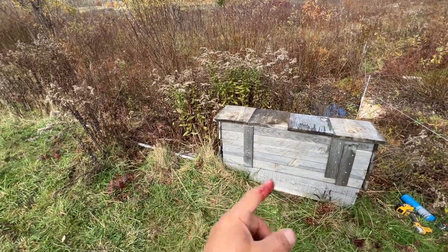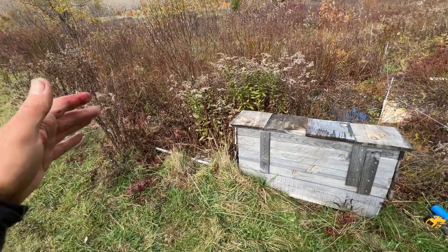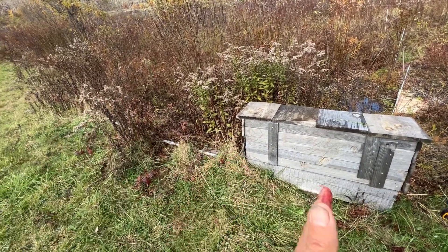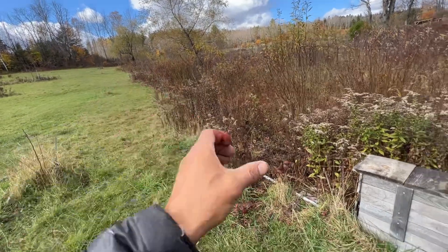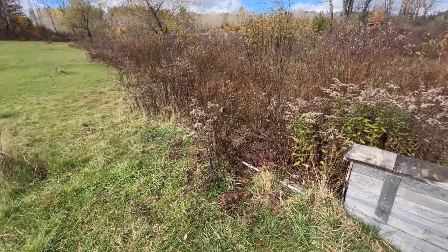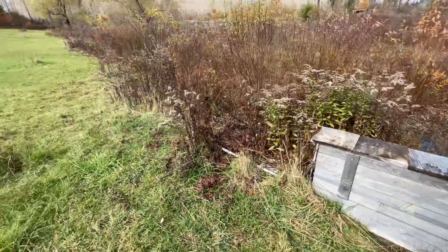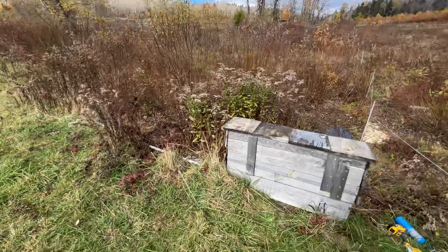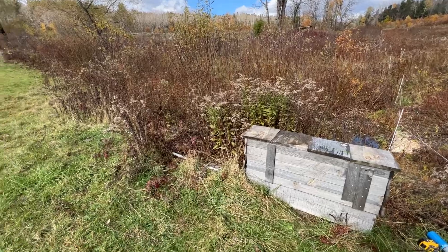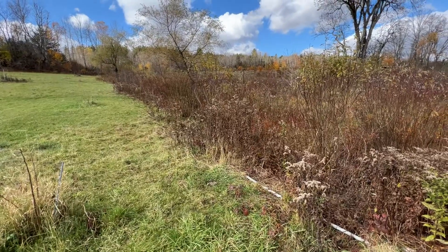The two check valves create this hammer, percussive action between them. It's the water column just keeping the flow going — maybe 20 feet of water column per increment per stop. I can measure it because the waste comes out the top of the check valve. I think I'm getting around 20% efficiency — how much output for input in terms of water used.